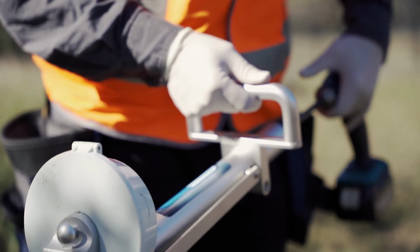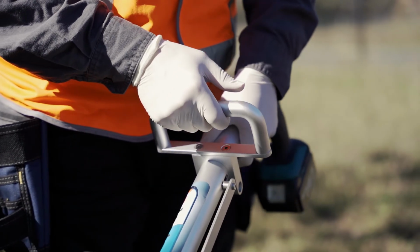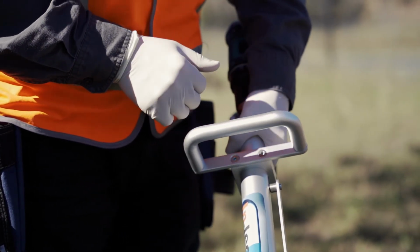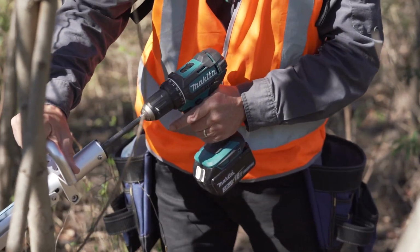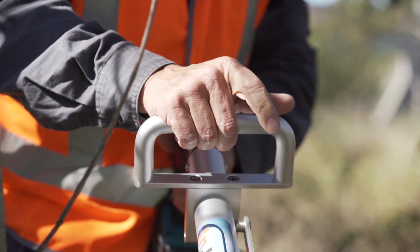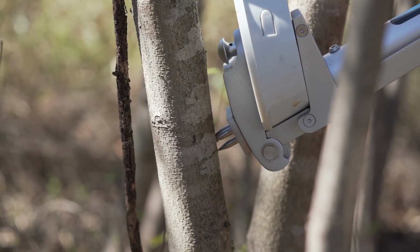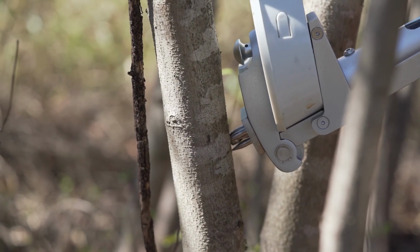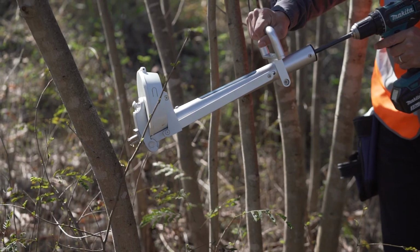The magazine should now be firmly engaged and the drill bit can be pushed forward through the empty chamber at position number 1. Hold the InJecta unit by the D handle with the drill pulled back slightly. This retracts the drill bit behind the pointed locator pins. Push the pointed locator pins on the front of the InJecta unit firmly into the tree stem to provide sufficient grip. This can be done with a slight jabbing motion.